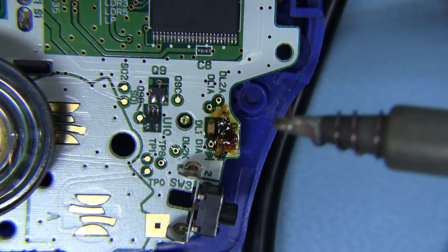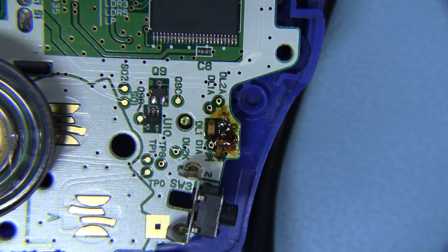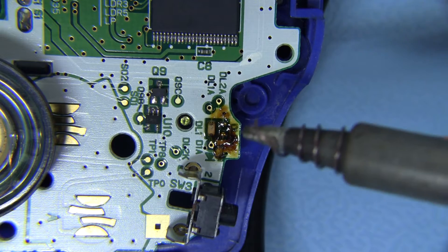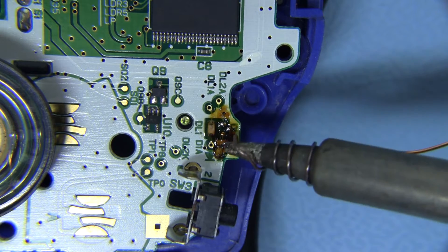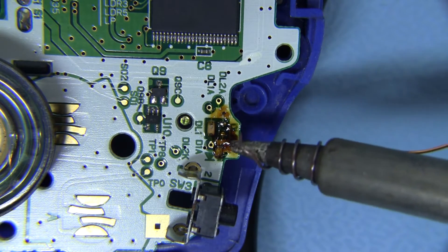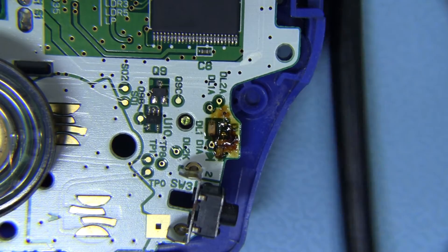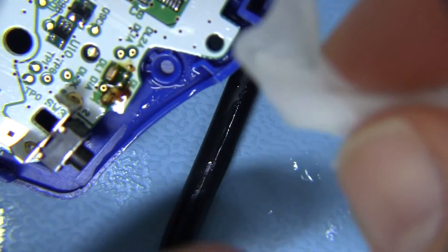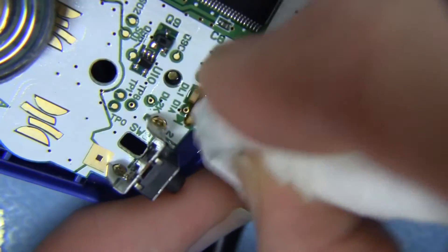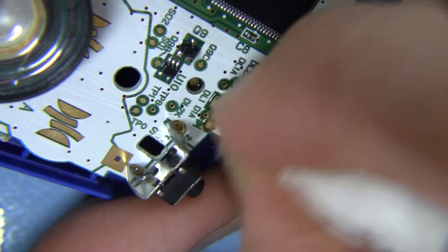I don't know if I got that on video, but there it was. I had my iron at about 425 and just flooded the thing with flux. I'm not sure how much the extra wire helped — I've used this technique successfully before with wire wrapped around but I think I had a much thicker gauge wire, which transfers heat a lot better. I'm not sure if the flux was all I needed or if I did need that wire. Either way, it's off. Now we need to clean up the extra flux residue. I might have also had too much heat sink from holding the wire with the hemostat. If you use thicker wire, the wire can support itself on there.